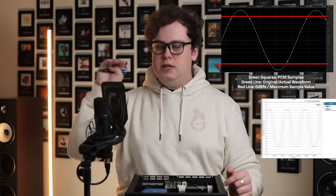Some of the constructive criticism I'd made — like the fact that this DAC is currently susceptible to inter-sample overs, where if digital samples are all below 0dB but the original analog waveform goes above 0dB, the DAC clips when it oversamples. Companies like RME, Chord, and Benchmark have gotten around this. We had a quick chat, and within a couple of hours the engineer said he'd speak to the team and see about getting a firmware update to at least provide an option to mitigate that. Awesome.